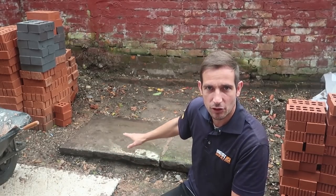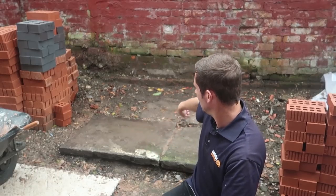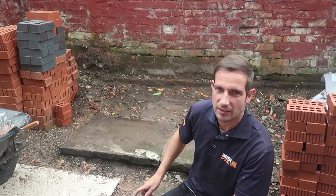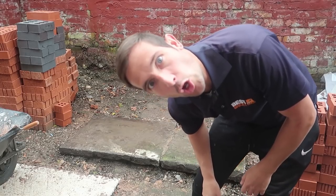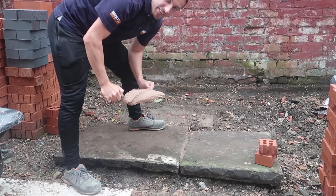We're going up seven courses — our gauge is 525mm, so that's what we're going for. I've got 25 minutes left on the camera. Now, I am going to level the first course because the platform is all over the place, so that's a disclaimer straight away. I'll level the first course and then from there we'll go up.